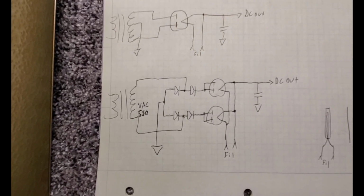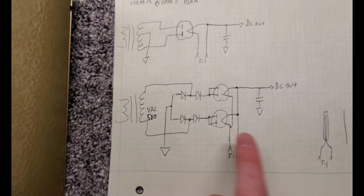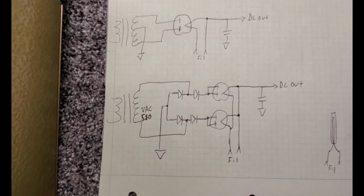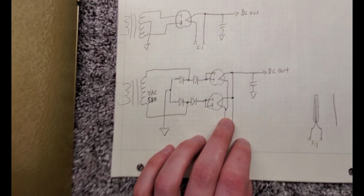That's pretty high for a tube rectifier. GZ34 is what we use. That's kind of on the edge of the data sheet for peak inverse voltage, but a good strong tube shouldn't be an issue there. However, that's not necessarily great design, stressing them that way.